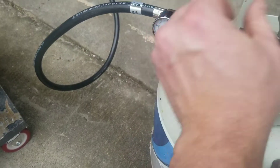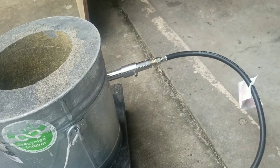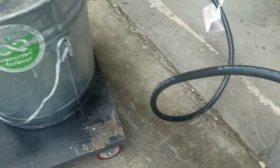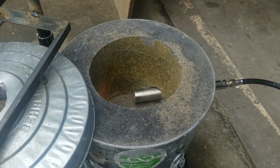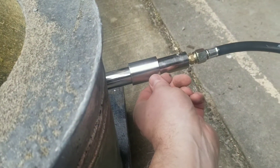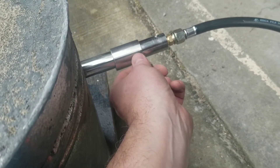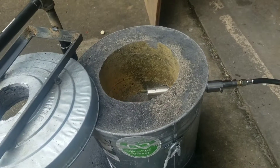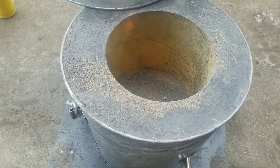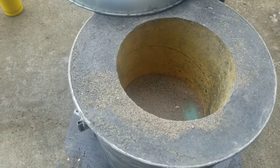Here's the initial firing up of this propane burner. I already have this set up and it's in there. I'm going to turn the pressure up — you can hear the gas coming. I have it turned on now. You can open this up; it lets a little air through. Watch you don't put it out. I have the burner in here pushed pretty far forward, so I'm going to pull it back a little. Doesn't need to be that far in.